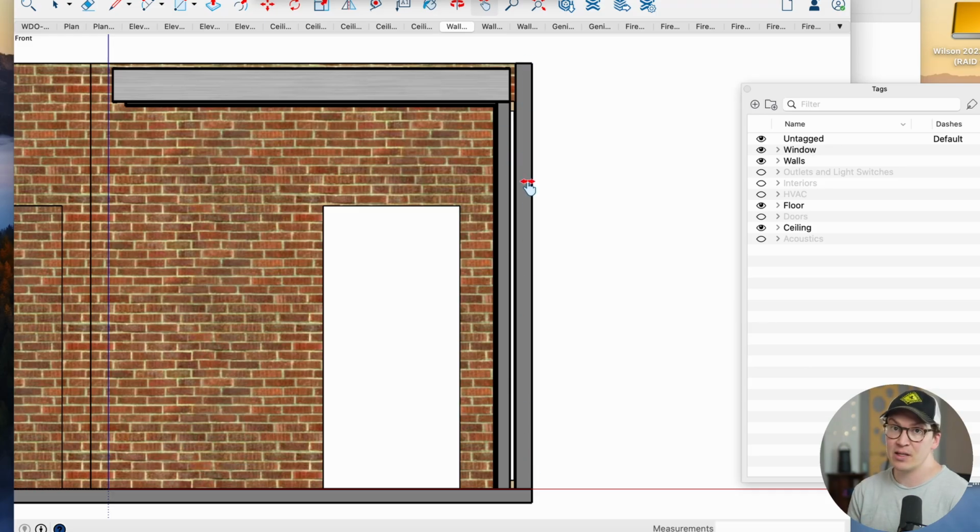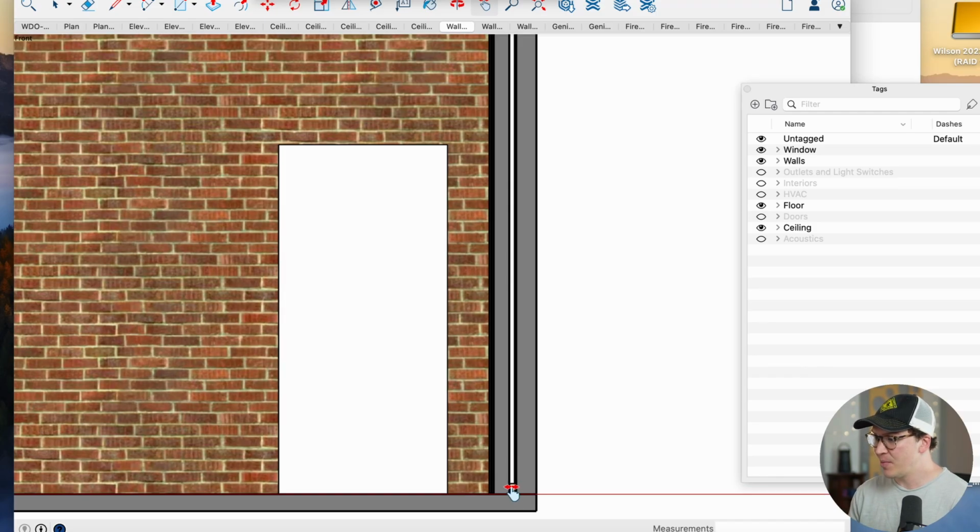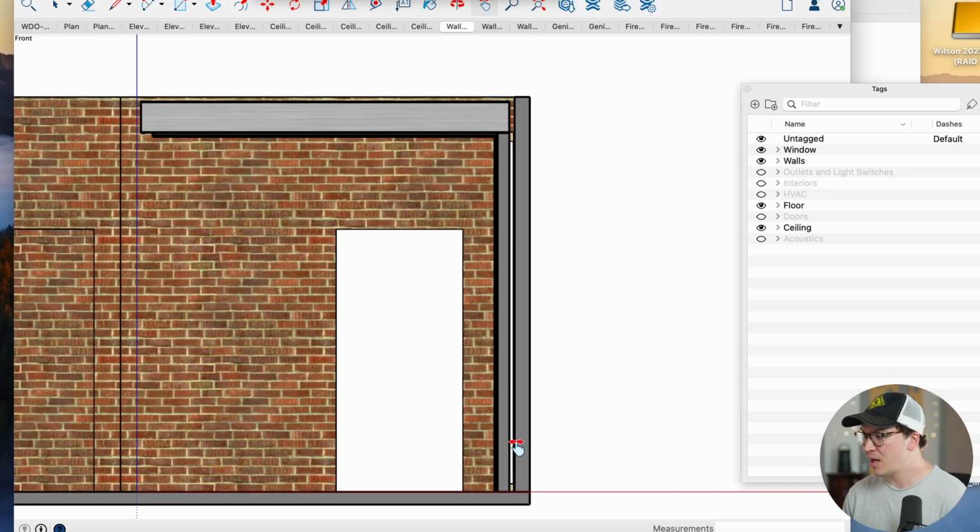And it's really nice. In different countries around the world, they don't usually use stick construction, meaning 2x4 wood construction, like we do here in the United States. Having a brick or mortar construction, especially with plaster on the inside, is great because it just weighs a ton. And as you know, mass is the best way to sound isolate. And then we have a 30 millimeter gap, which is a little bit more than the inch gap I usually do. But I decided to round it up to 30 millimeters instead of the usual 25.